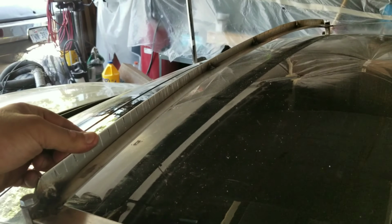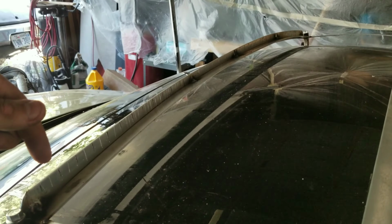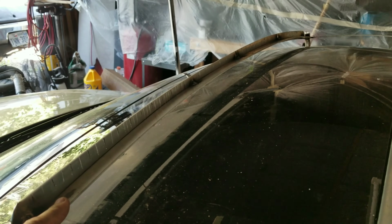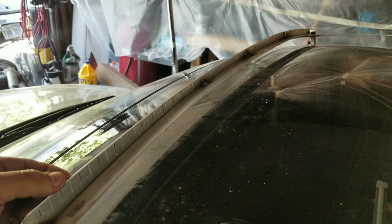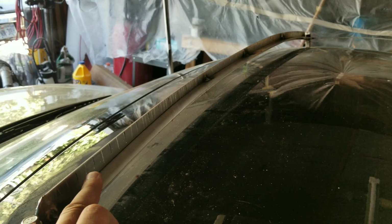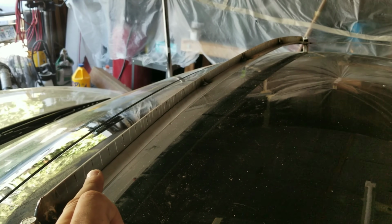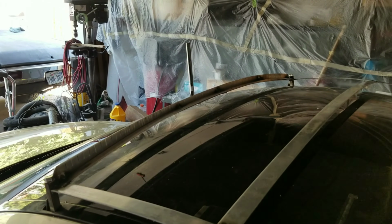So here's the idea. Just like how I explained earlier, what I did is I marked out about an inch apart, and then I left at the bottom of the flat stock probably about a little more than the thickness of the actual piece of flat stock. That way all of the strength stays at the bottom, and when I hammer it down into these cuts, the metal is stretched out as you would do with a planisher.